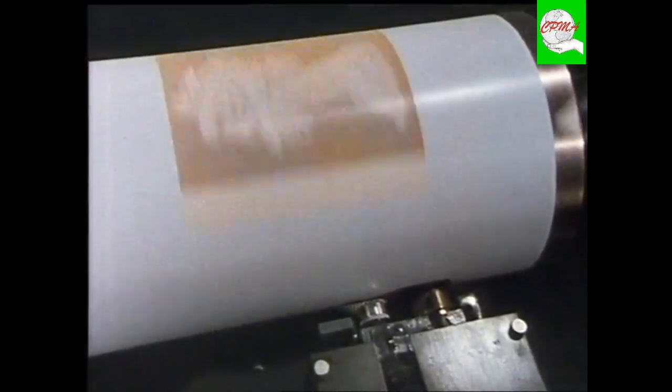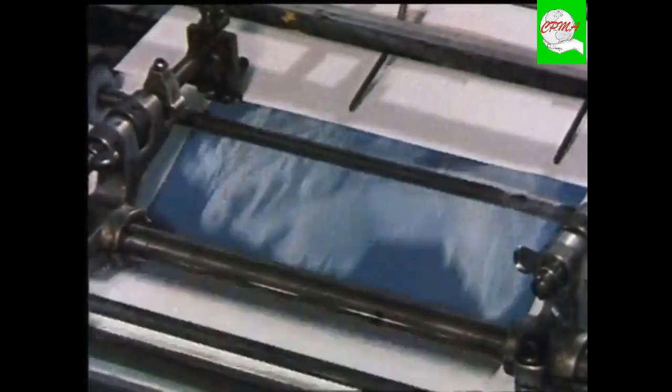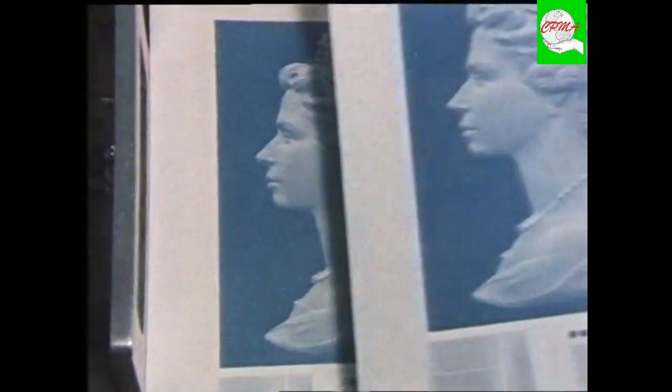Normally, the image etched by the laser would barely show. But here, the printing cylinder has been specially treated so we can see the result. On the real plate, it takes careful lighting to show up the very fine grooves from which the image is made. Ink will flow in and out of them during the printing process. These new prints are so cheap to prepare that they're ideal for mass production. Yet here, as in many other sectors of industry, the laser produces results of unbeatable quality.